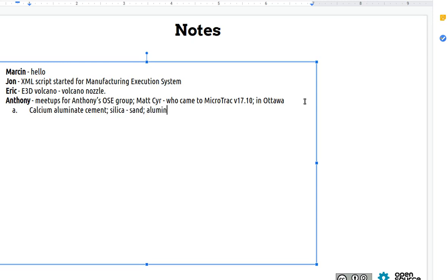What are their properties that make them ideal? Well, they're just inert. They don't undergo phase transitions. Especially zirconia, they're stable. Zirconia actually has a small amount of yttrium added to it to stabilize it against any phase transitions. The pure zirconia does have some phase transitions, but they pretty much always have that stuff.